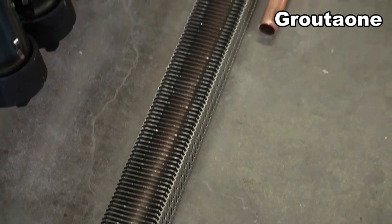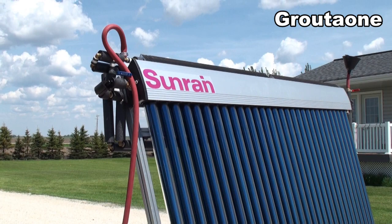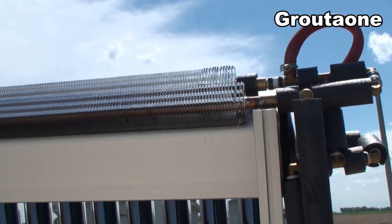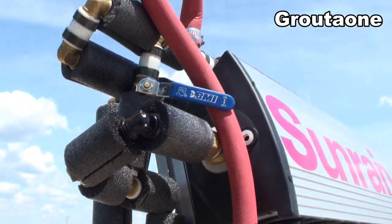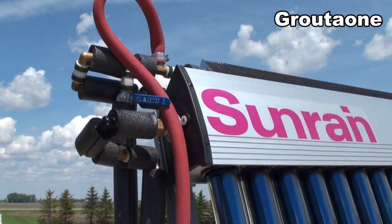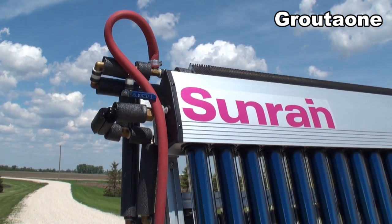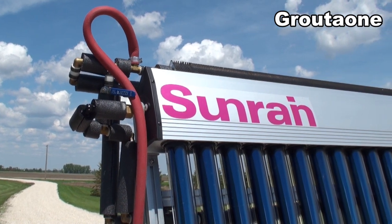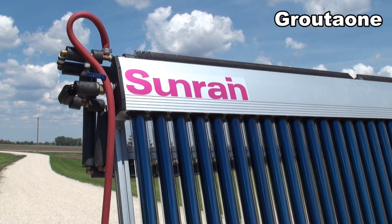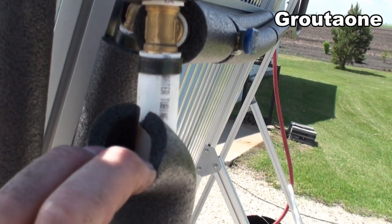The last time I was showing you guys the fin tube that I had laying on the floor. I'm running the system right now through one of the fin tubes — I've got it sitting up on top here. I've got two rows up there and right now I'm only using one. You can see the red hose there — that's actually part of the venting system, which is pretty critical for this experiment because I don't want to be building pressure without an expansion tank. It runs open, meaning it'll boil at 212°F. It was starting to boil before but it seems to be under control right now with it running through the one set of fin tubes.